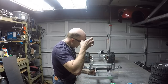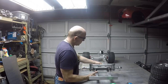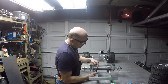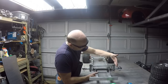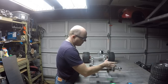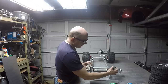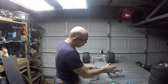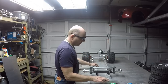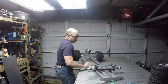I will be adding gussets right here. There's some finished welding I need to do — some inside corner welds on the frame as well as some cross supports. This front end assembly has a tendency to bend inward, so I'll be adding gussets for strength. What's interesting is this small front end assembly in steel weighs more than the entire aluminum frame. It's just amazing the difference between steel and aluminum when it comes to weight.